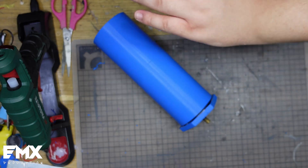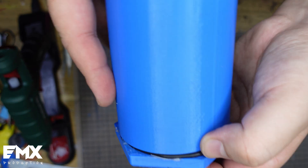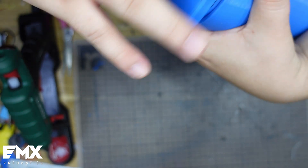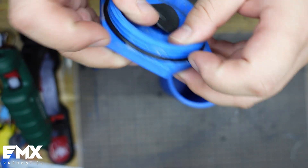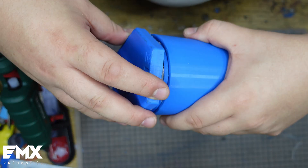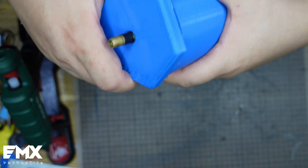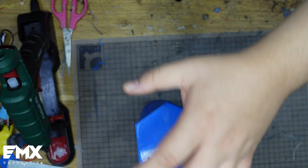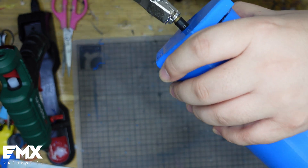So we lost the seal — it blew the seal. If we didn't have the problem with the seal it would be good. I couldn't find a proper seal so I had to improvise with this one. It can hold easily 20 to 30 PSI; after that the seal goes bad. But for sure you can 3D print and pressurize a cylinder.